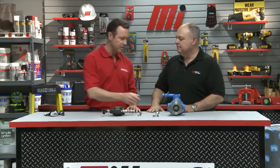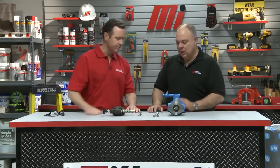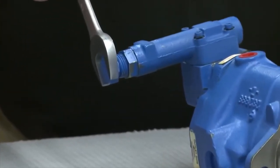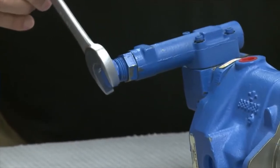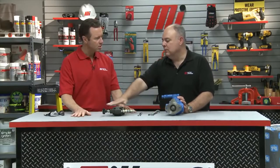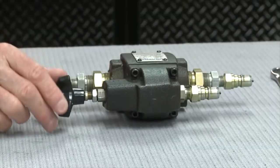We've got different knobs on this equipment. This is our pressure adjustment knob. In the video, you'll see him making an adjustment here. If we screw it in, we'll be increasing the pressure. If we back it out, we'll be decreasing the pressure. And of course, the same would be true for the relief valve — turn it in for more pressure, open it up for more relief of pressure.